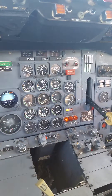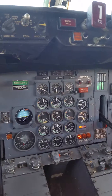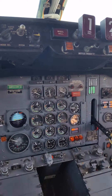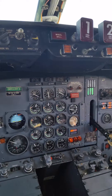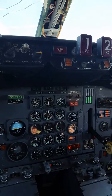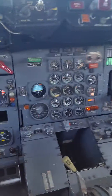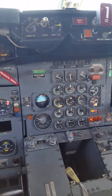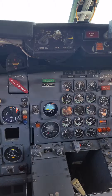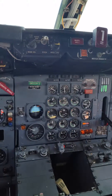You have to learn what the throttle will do for you. The ones we use for takeoff are the top ones. Any other time, you can set power with any of those gauges — you can set it with N1, N2, EGT, or fuel flow. I've seen different pilots that have different techniques: one guy likes to set temperature, another guy likes to set fuel flow. So that's something about that hung start and hot start. If you had a hung start, it would not accelerate past about 40% N2 — the N2 will shut it down. Now if it's a hot start, your EGT will go through the roof but the RPM will be low, like maybe 20% or 25%, because it doesn't have enough airflow going through or it's got too much fuel. And you shut your thing down.